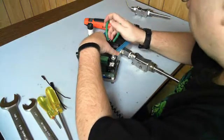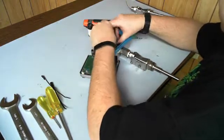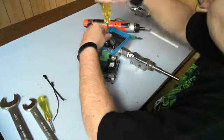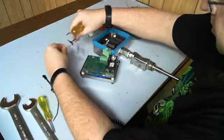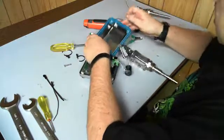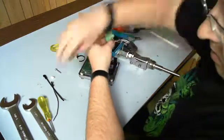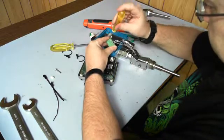Take a pair of snips — or you can very carefully wire it through — but it's easier to remove the ferrites by cutting with the snips. Remove the screw, remove the ferrites on the spacer, then disconnect the wires from the connector.